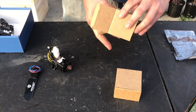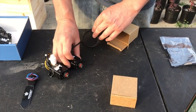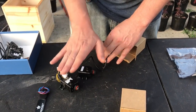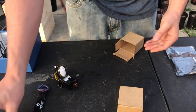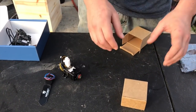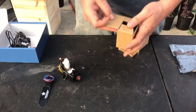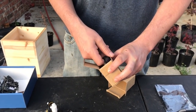This came with an extra pump. This is if we were going to run two pumps — we'd glue this one down in the reservoir next to the other one and run them together. But we only need one level switch because the water level is going to be the same. We're not going to use this today — we're only going to be using one channel because this implementation is going into a customized self-watering planter. You would use two pumps if you needed more power and were setting up a personal cultivation setup for six to eight plants.